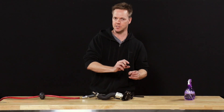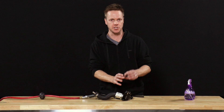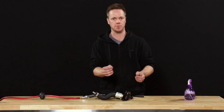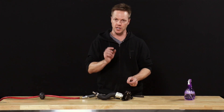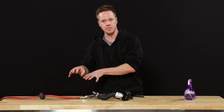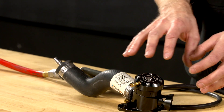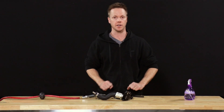The piston has to have a small amount of clearance. Typically even if you run the tightest machining clearance you possibly can, this will be somewhere around about 0.02 millimeters — so that's the kind of gap we're talking about. To show you what's going on, I'm going to use a compressor here to push some pressurized air back up the recirc and show you what sort of size leak we're talking about.